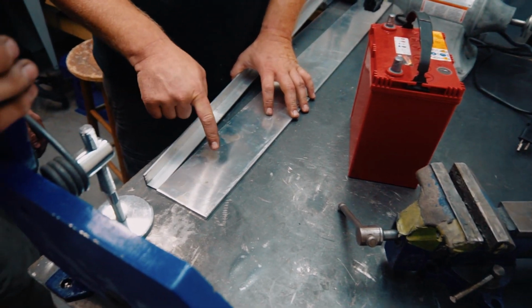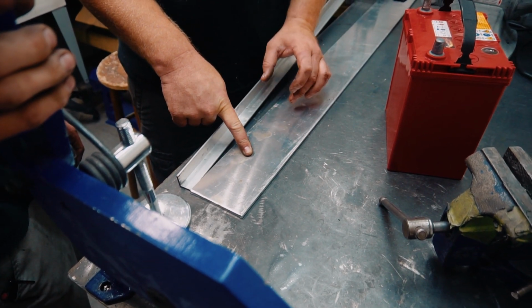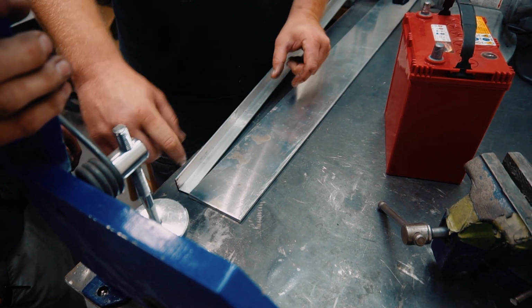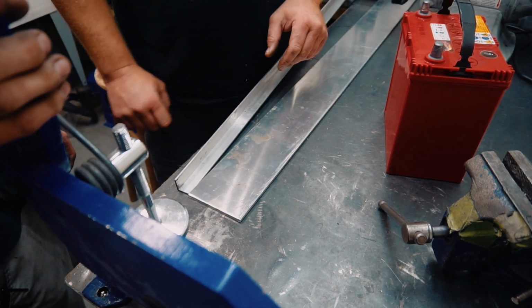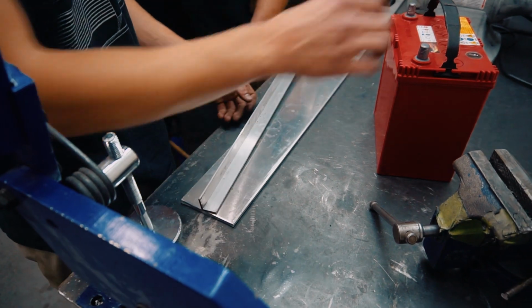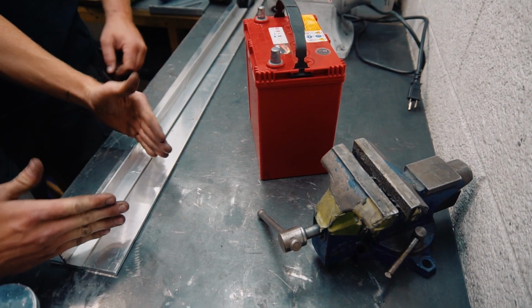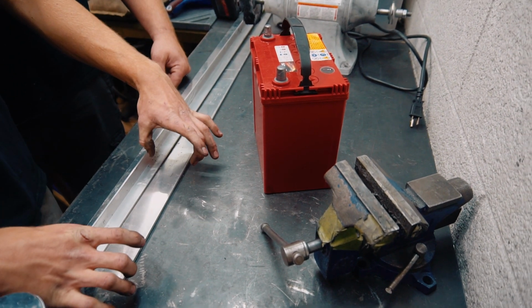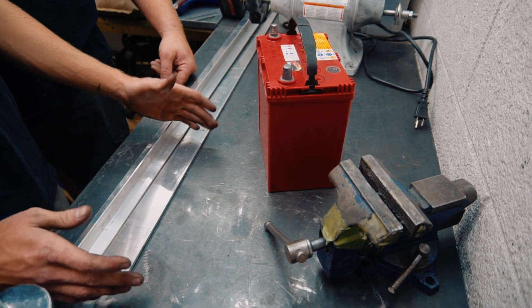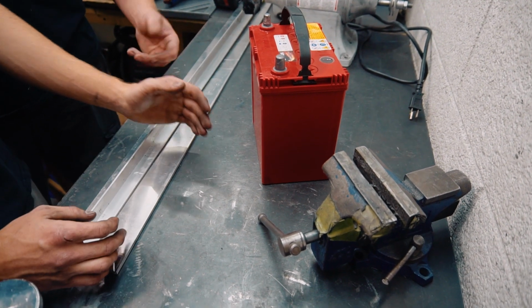And then on the center I have some thinner stuff of this. It's probably about half this thickness, and I weld that in the center to give you something extra to support it. Okay. Now you just weld it all together around the outside. Correct. So get the measurement for this, leave an 1/8 inch on each side. Cut a 45, make the pieces up, and then take 2 center pieces and run those through. Or just one. I mean, normally.